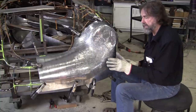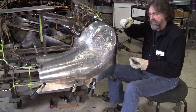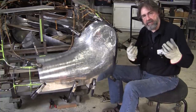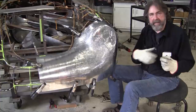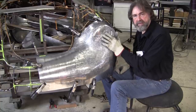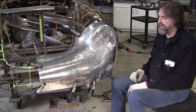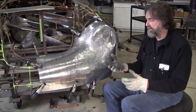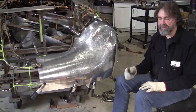It's not the ideal way to shrink, as I mentioned, the way the Polish firm that used to do the Soviet MIGs. They have that really nice station where they're pulling down on the metal around its entire perimeter. There's a lot of extra metal on the panel, the blank that they're starting with, allows them to put grippers on, and that's all cut off after. And that pulling down allows them to trap the metal really well, plus they're working with annealed panels, I believe. And it makes it a lot simpler process. If anybody's going to do any production, next to making a complete die set, hammer forming like the Polish factory did those Kirkham Cobras, that's the way to do it.